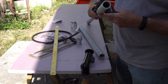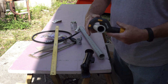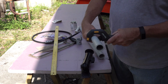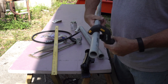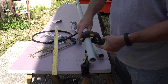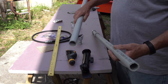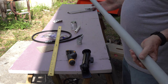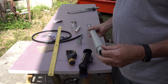For anybody who's ever used one of these rotary cutters, they do a very nice job. Even if you just want to use it to get your line started for your hacksaw, it still does pretty well. You just put it in there, tighten it, and as you turn it back and forth, the little rotary blade starts scoring the PVC. Now that I have my two pieces of PVC pipe cut to the length I want, let's just make sure that fits inside — and it does. That's going to swivel nicely. Now I'm going to sand this end down.